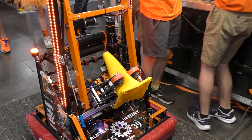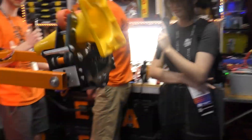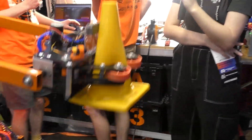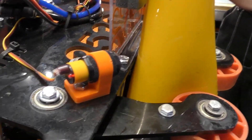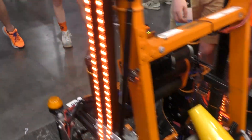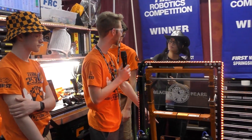Here's high. And here it would be a double substation pickup as well. Notice here — there's a red light on the center. That means it can see the cone. These are proximity sensors and we have two on the lower intake as well. That allows us to know when we have a game piece in either the gripper or the intake at any time. So that allows us to write our autos without having to worry about timing — we know there's a game piece, we know when we can hand off to the gripper, and we know when we can place.